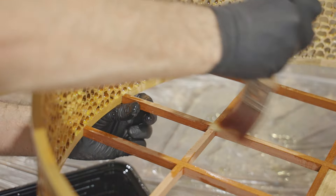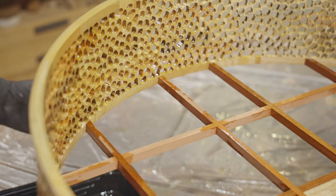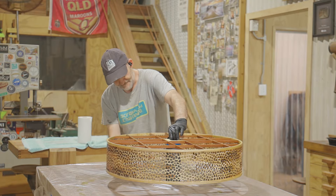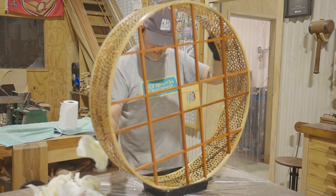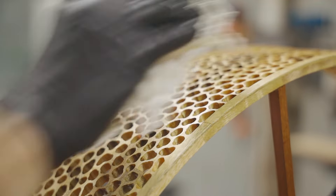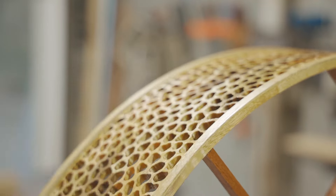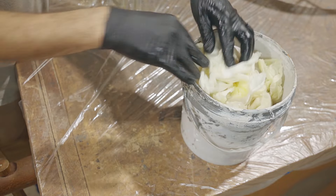For now I'll leave it with just the one coat of oil, but when it dries thoroughly in a couple of weeks I'll sand off any furry bits and spray it with varnish. I'm wiping off as much oil as I can and leaving it a while, then doing it again. I used half a roll of kitchen paper wiping it down and then safely discarded it by submerging it in water.